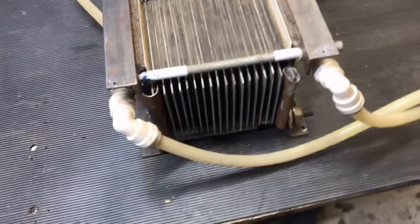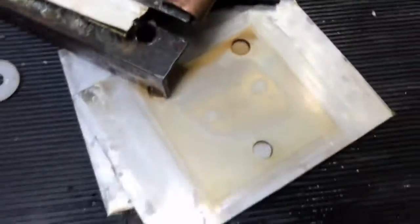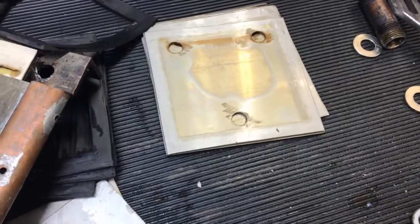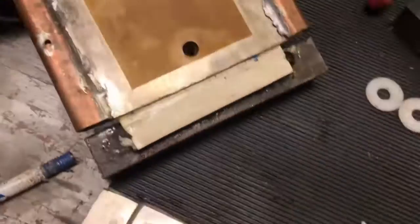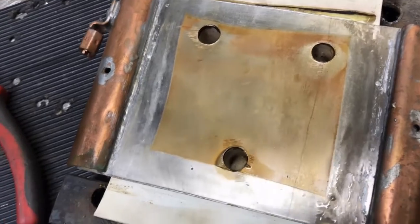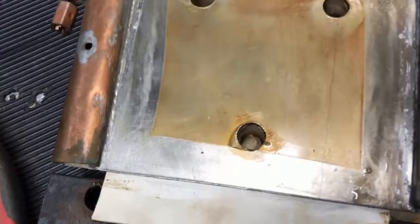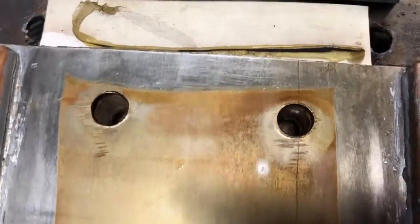Well, there it is fellas — not too bad, granted that I use this thing almost every other day, sometimes every day, for two years. This is the anode obviously — it's the dirtiest one. And this would have been the cathode; the cathode side produces hydrogen and as a result most of the buildup just flakes off. It's actually a self-cleaning process, though it is a little bit damaged there.